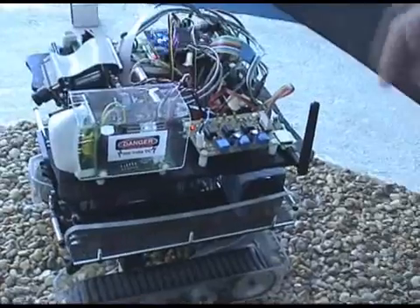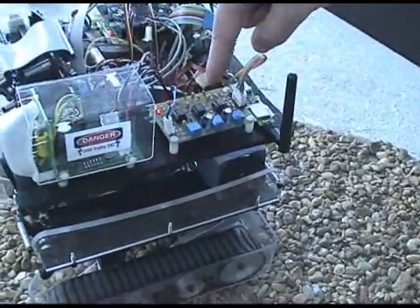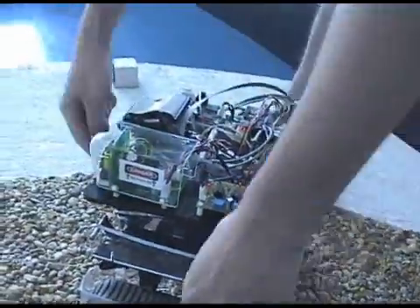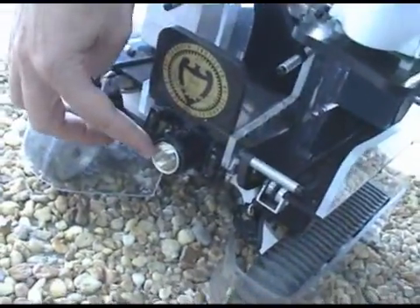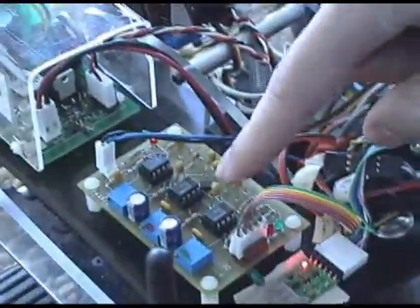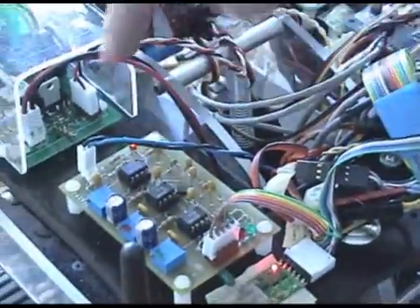We're not actually going to shock dogs. So then this here is a beacon detector. What does it use to detect the beacons? It uses this infrared phototransistor on the front that's mounted in an old flashlight reflector. So if you point this at the beacon and turn on the beacon — the beacon has IR lights and they blink at a certain frequency. That's how you tell the difference between the corners. There's an op amp to amplify the signal and then these are tone decoders — they look for a certain tone.